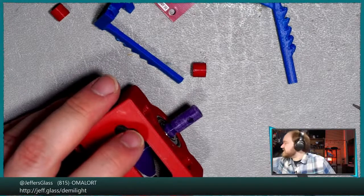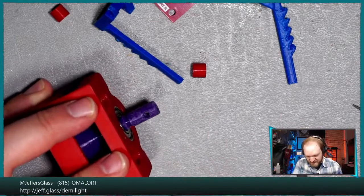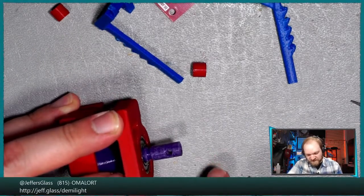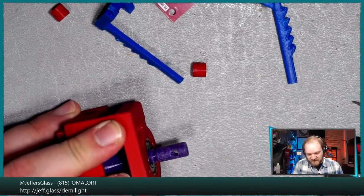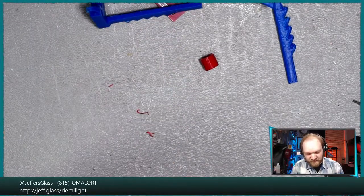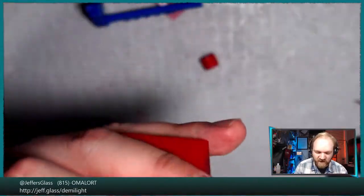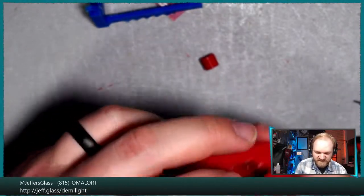Now, it should be all right because I left a ton of clearance for the ratchet pawls, so that if this surface ended up super rough, which it obviously did, I should still have plenty of clearance. But, of course, because those pawls are going to be under quite a bit of force from the springs that are pulling them together and trying to get them to engage with this ratchet wheel, I should make sure that those are at least decently smooth. We can probably just test fit this in place. This is obviously not the final orientation, but that's already moving quite well, thanks to that extra tolerancing. So I'm not too worried about making these pristine.